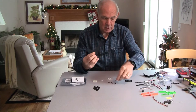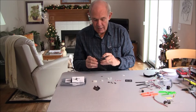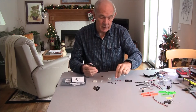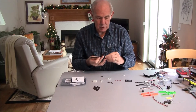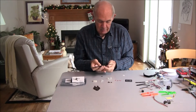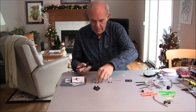To build this, I'm going to use all these black screws on the bottom so my area is flat. You can put your PCB board standoffs through and build up. I thought with the combination of screws I would use all the flat black ones on the bottom because I'm going to need to put my battery there — or at least have something flat even if I don't put the battery on the bottom. These steel screws will hold up a little better than the nylon ones for sliding since there's really no landing gear for this. So first step is to put four of the screws through the bottom of the quad.